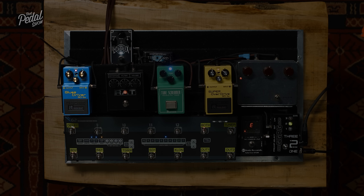you've got two clippers. Clippers after clippers, yep. Two clippers after the op amp. And those switches give you options for the two clippers. So you can have them both the same, or you can have them different. If both are the same, you have symmetrical clipping. Different, you have asymmetrical clipping. And there are loads of different sorts of asymmetrical clipping. We'll get into that in a second. But for now, I've just got both silicon diodes on.